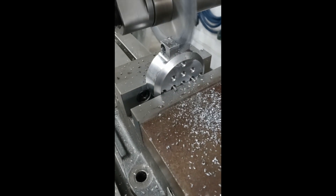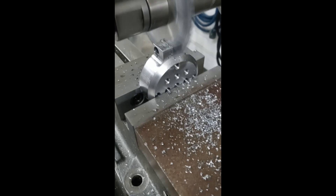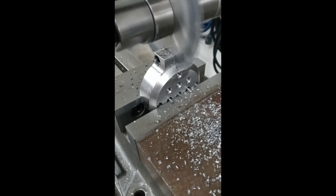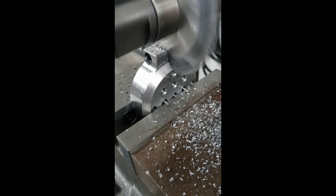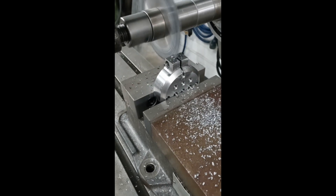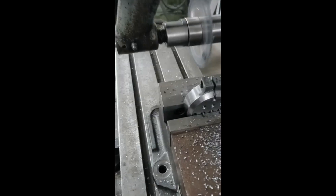It's just cool. I mean, how else would you do this kind of deep, narrow slot in steel other than getting into some high-tech newer stuff like EDM? And I can just come over to this machine and set it up in five minutes. A lot of the times we have a saw sitting on this all the time because we use it a lot for slots, so you can just come over here - quick, easy setup. We're cut all the way through. Literally like a 10-minute operation even when you only need to make one part.